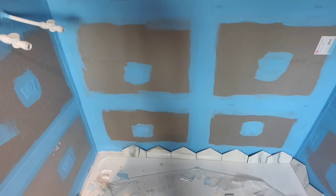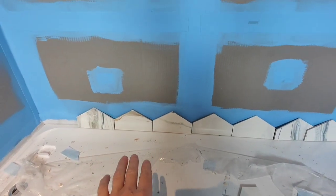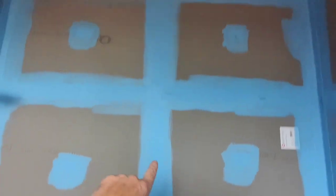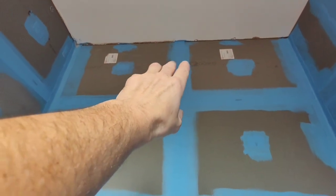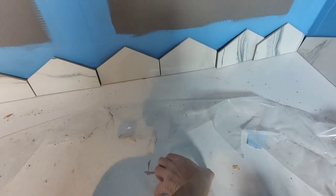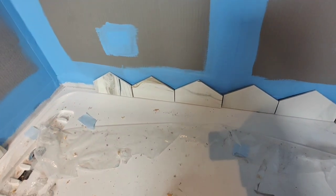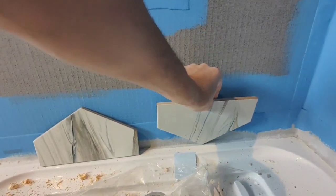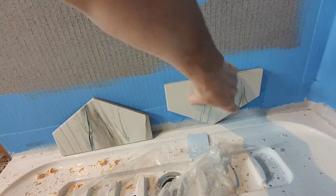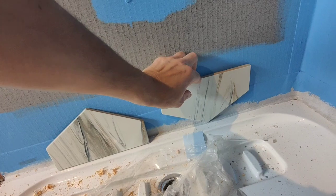I haven't done these before. I've been looking at pictures online and they all start off with like a half tile. I've measured it up and it works out to a cut at the top but it's not too bad. Then obviously a full one goes like that, then full pieces up — otherwise if you put a full one in, you'd have cuts there and there and you'd have to balance tiles on points. That's probably why they all do it like that.